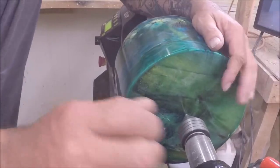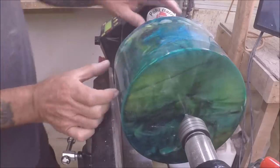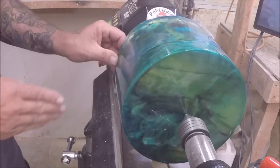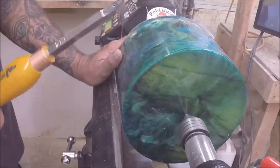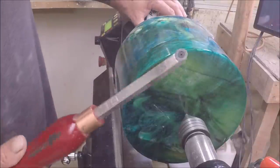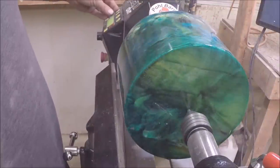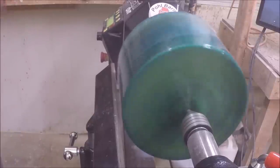Before I get the gas mask and helmet on, I want to establish where we're going all the way around. Roughly in here is going to be my base, and then I've got to cut in from my rim and do my bowl opening. I want to get the face mask on because I don't know what's in those shells. I'm using the pointy tool from Easywood to establish where I want things, then probably going with the carbide rougher. I've only got about 975 RPMs - that's the best I can do. Anything slower, the lathe walked away; anything faster, same thing. That's my sweet spot.